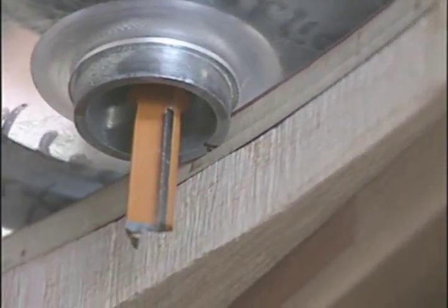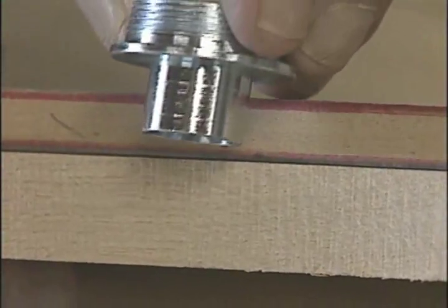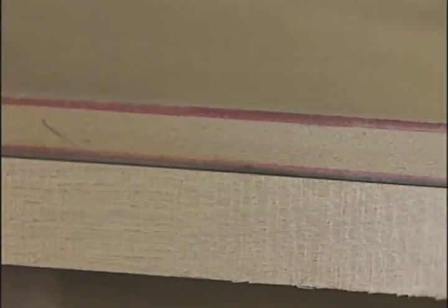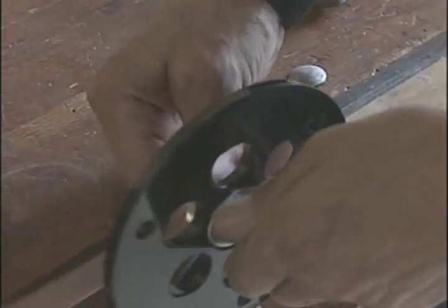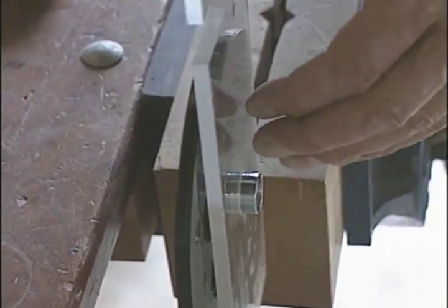All collars need to be shorter than their templates are thick, otherwise they'll just bump into the work. But collars come in many different sizes, and the one you have may not be right for your template thickness. We'll cut this one in a subbase. I put the base in a vise and screw the guide together. I'm using a plastic guide shield for the hacksaw.